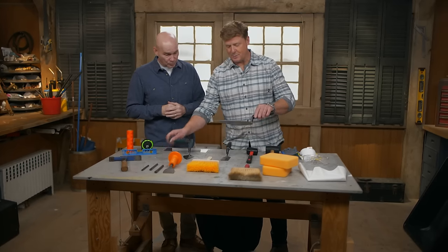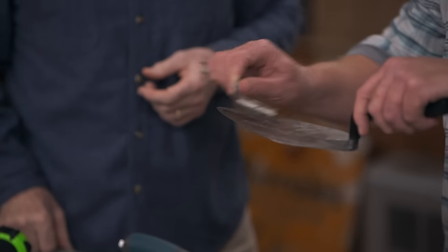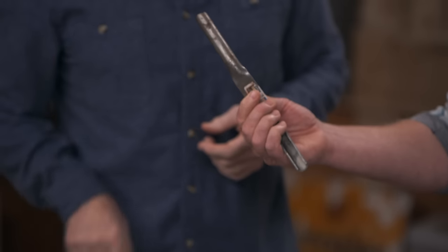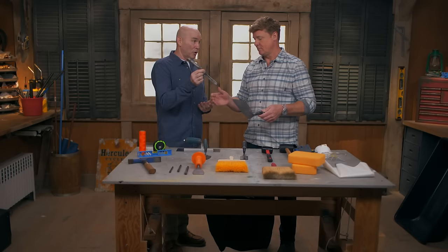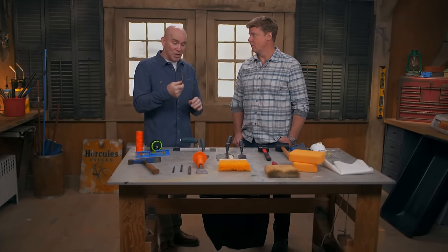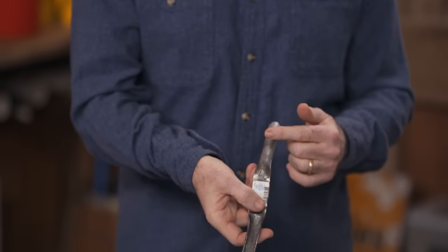We've seen you use them by themselves, but then we've also seen you use them in combination — two tools as one. That's right. Fill it up with mortar, push it into the joints. This is a jointer, very simply. I'll go in and I'll fill the joints. But this edge right here is also what we call a slicker. The final pass that we make on that mortar joint is going to be slicked — that's going to protect it from the water and the rain. Seal it up nice.